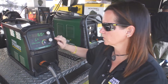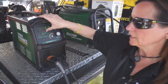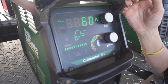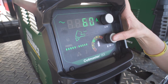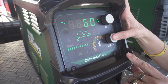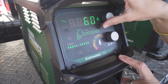The lower knob, when you depress it, you'll notice this image will change and you'll see additional segments light up. Each of these segments represents additional lead lengths for the torch. As you increase the torch lead length, you need to increase your air pressure. You'll notice that as I increase this, the gas optimizer will change, suggesting that the user increase their air pressure if this is their true setup.